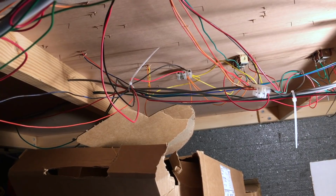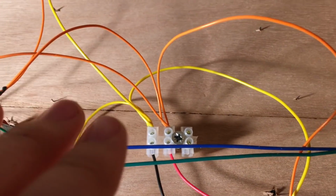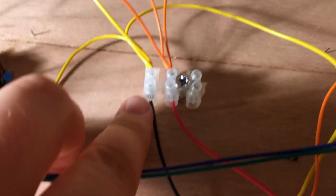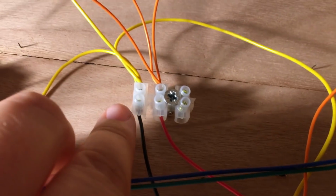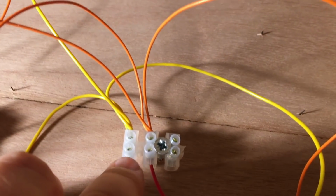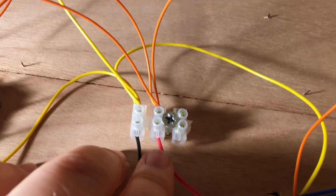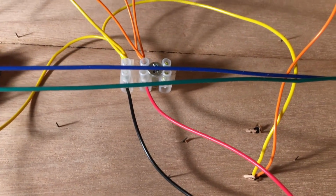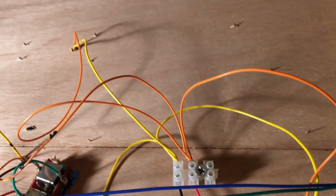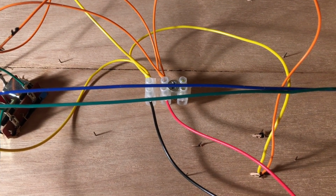Now my wiring, as you can see, is really not the neatest. Never was, never will be, not really bothered about it. So we've wriggled underneath, and just part those wires out of the way. It's my left and the right. So what I'm going to do with this bus suppressor kit is to take one of them. Each kit comes with two. I'm going to connect it across from that terminal to that terminal, and that will provide suppression in this part of the DCC bus. I can then go elsewhere underneath the layout and look for somewhere else that would benefit from putting the other one in, and so forth, and just keep going until we've used them all up and got every area of the layout adequately protected.